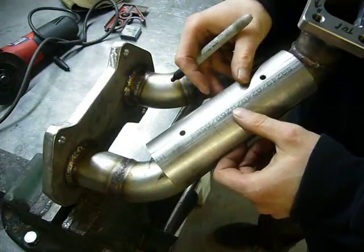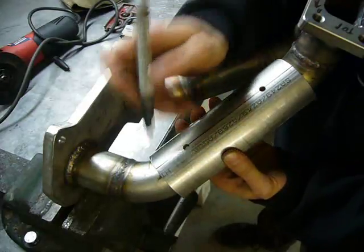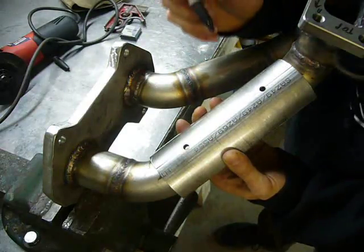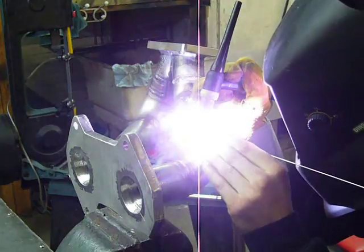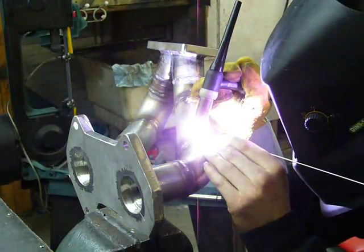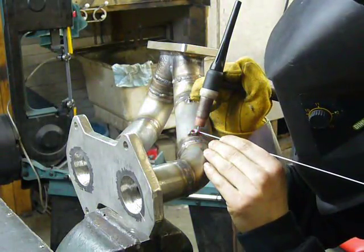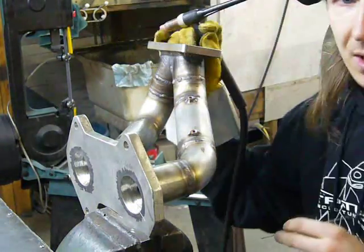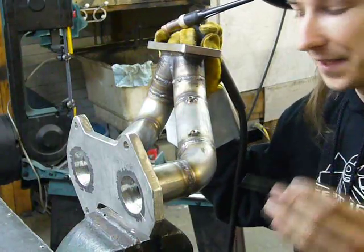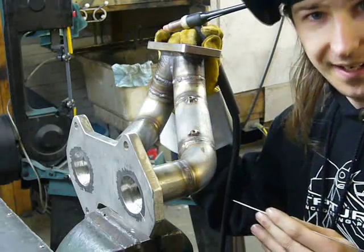I'm just going to weld some nuts to the runner to hold this thing in place. So the next step is to mark my position. Wow, that's delicate work. At each point of the nut, I'm putting a TIG weld. Problem is, if I screw it up on the last weld and melt some of the threads on the nut, I gotta grind it off and start over again.